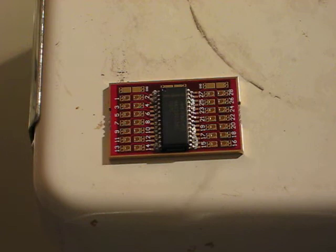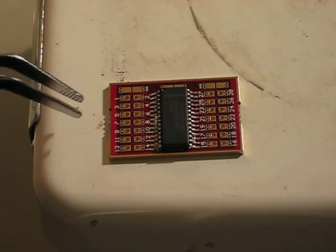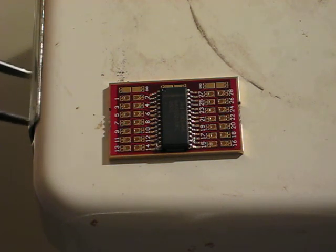The board is smoking a little bit and there flows the right side. It gets nice and shiny and wet. It's also kind of nice because the surface tension of the solder will actually pull a chip right centered on the board. Alright, cool. Looks like that's it.